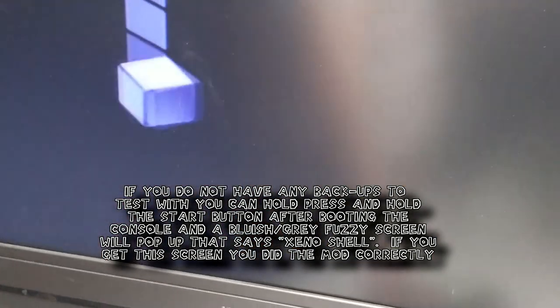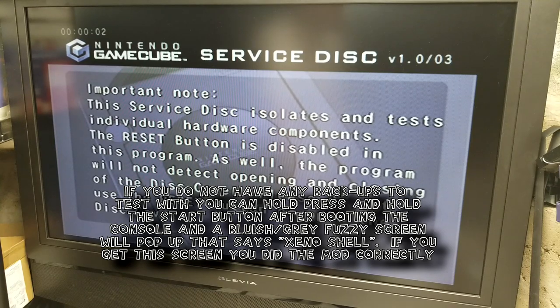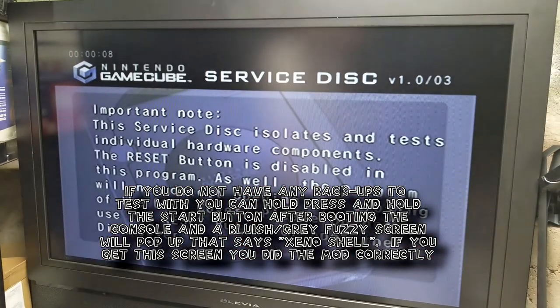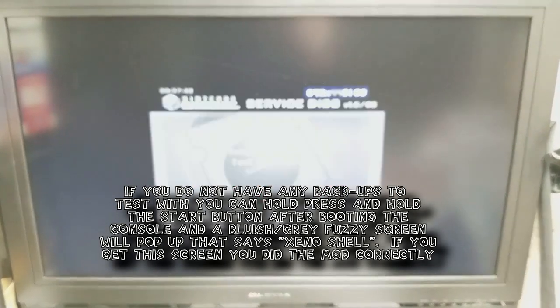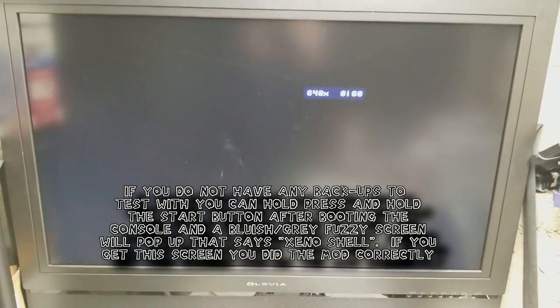Time for my favorite part — testing. I've got what's called a GameCube service disk or test disk, which Nintendo used to service all their GameCubes. It's obviously a burned disk, so we're going to try to read it — and it looks like we got a winner, it's reading no problem. If you're not putting the lid back on, there are two lid switches you need to push down. Overall, not too bad of a mod — pretty easy, just take your time, be diligent to hit your solder points, and make sure you're using flux and all the right tools. If you have any questions please let me know in the comments — otherwise please like and subscribe, have a good one.